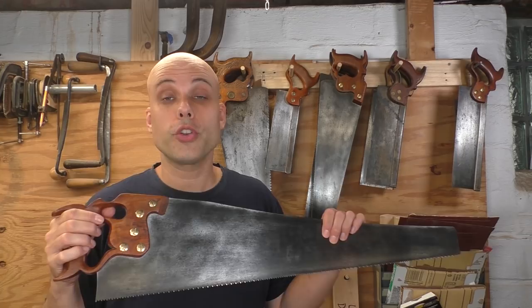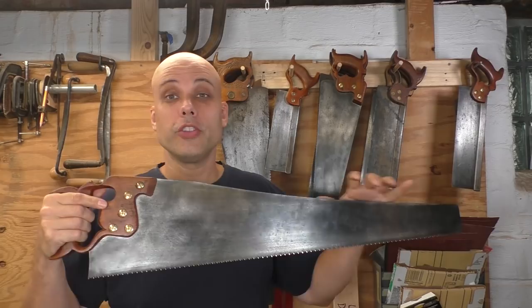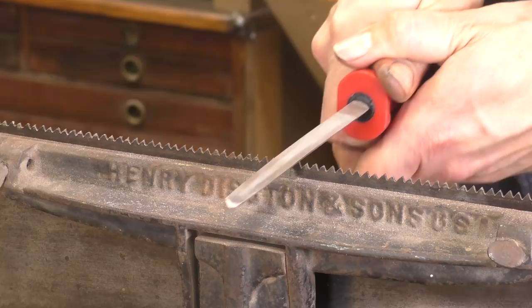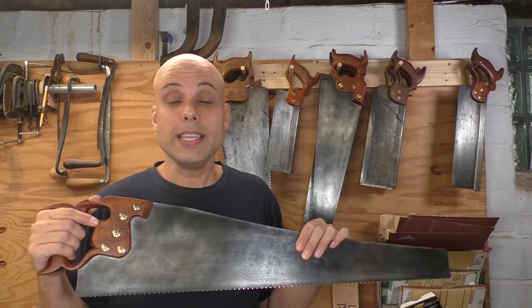Tempering brings in some toughness and flexibility, so they don't hold an edge quite as well. This brings us to the standard woodworking handsaw. It's made of high carbon steel, hardened but also tempered, making it really flexible — you can bend a saw like this a lot and it still comes back to its original straight shape. The tempering also makes this steel softer than a file, so a file can sharpen it over and over again. A high quality handsaw like this will last for years or even decades.